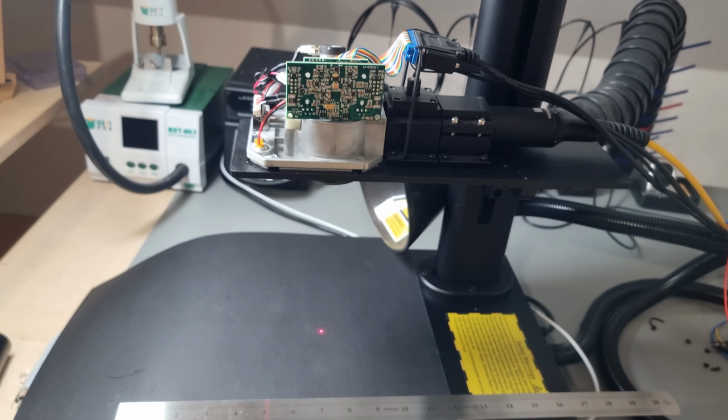The biggest challenge when using a Galvo for laser scanning is that the focal length is a constant around the lens. You could imagine it as a sphere around that circuit board. But for engraving we want a plane to be in focus, such as that threaded base plate of the machine. Don't shine lasers at planes, kids, that's dangerous.